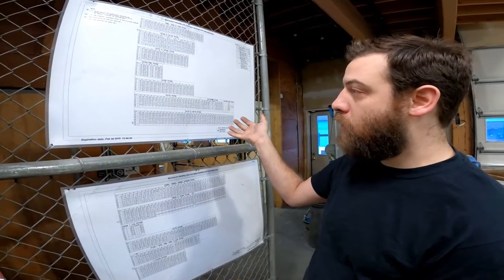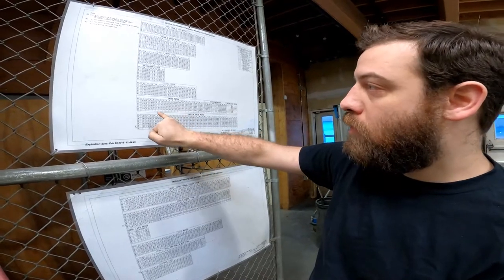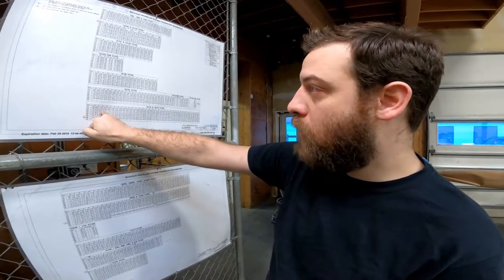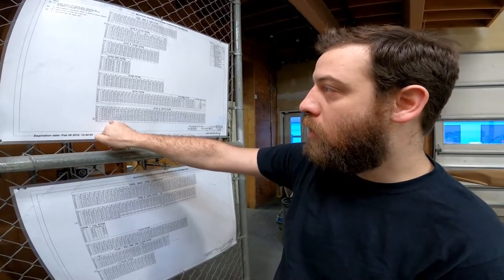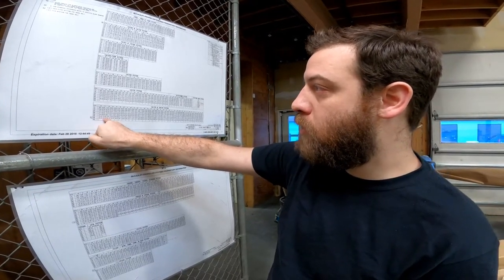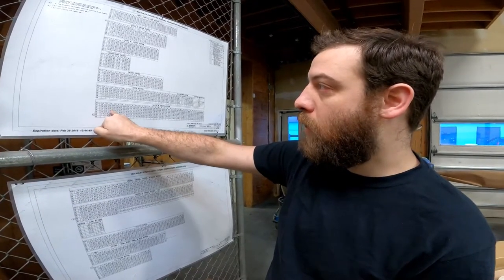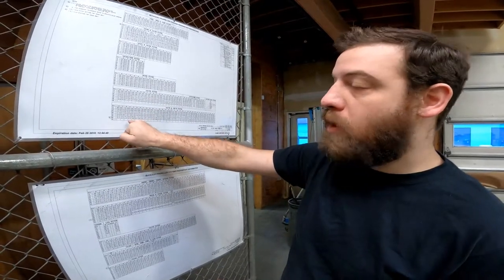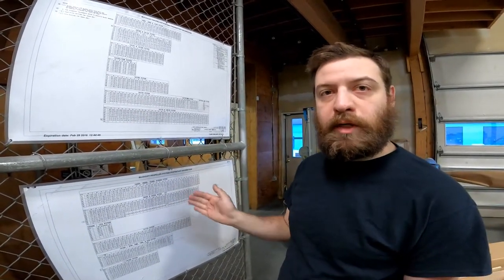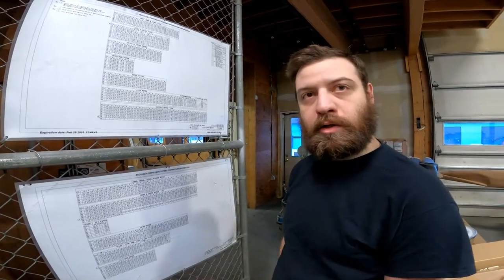Find the bore prop on the chart, which is a 1A175. The pitch is a 42, and that shows me all my station angles for the 42 pitch. Typically, between the two pitches, it'll be 4/10 of a degree, and then I'm going to go and verify that all the stations match all of these within 2/10. You can be 2/10 low or 2/10 high, and they'll still consider it a 42 pitch.